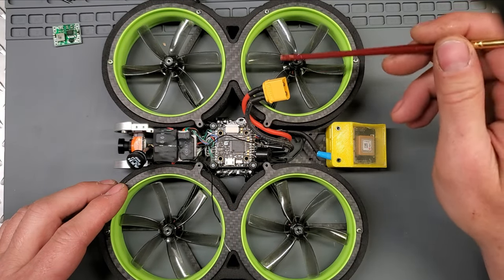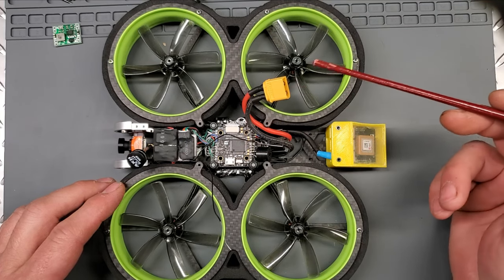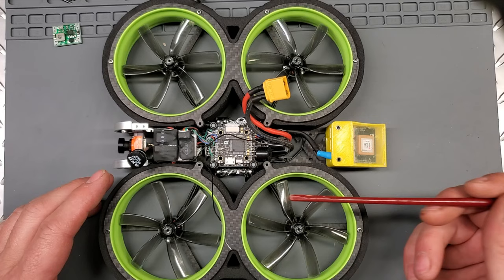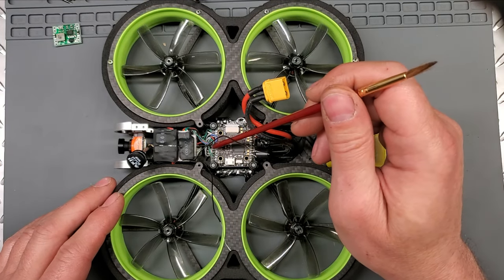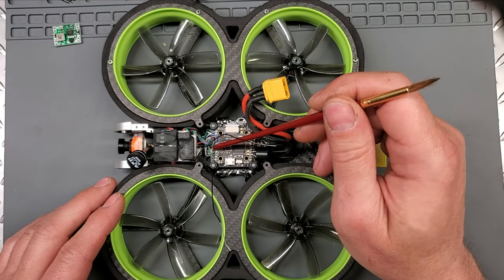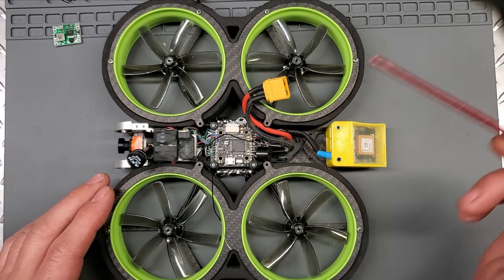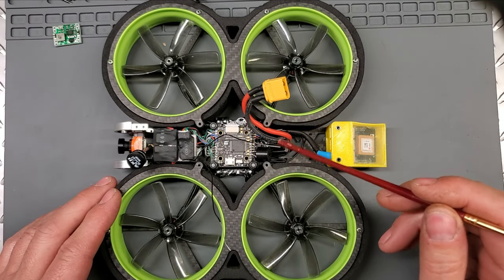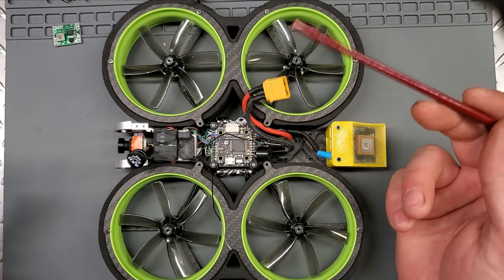As we know, our motors, especially larger motors, can get voltage spikes, and you can just get voltage spikes by just plugging in the battery. It doesn't matter how much capacitor you have on the back of it. So what I did here is I used the VBAT. I don't have an 8-volt pad, so I used the filtered VBAT pad off of my flight controller. Being filtered, it goes through the battery, the capacitor, the 4-in-1 ESC into the FC and then out, so it's filtered.